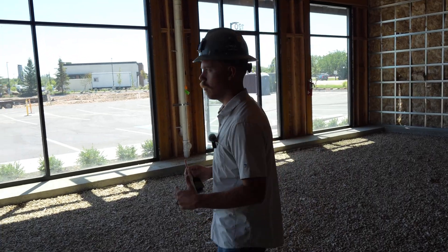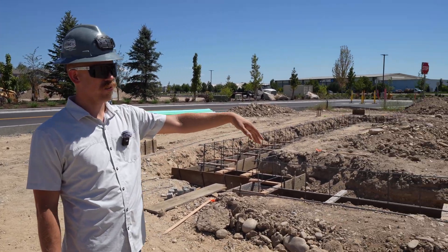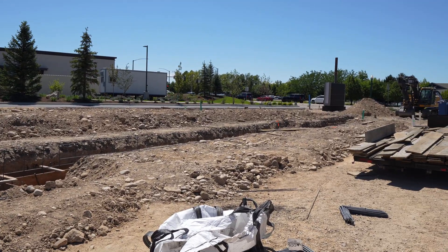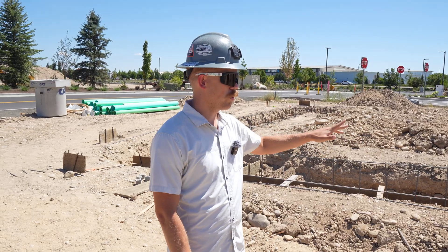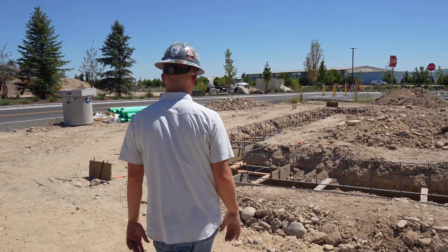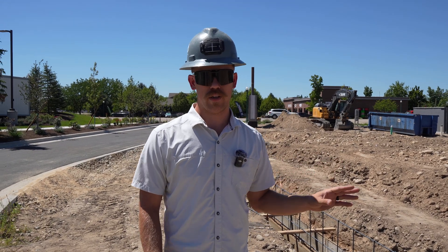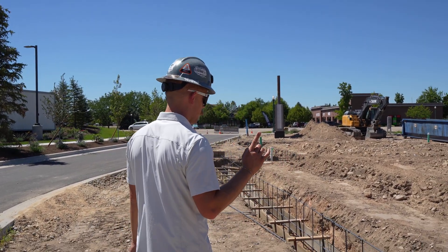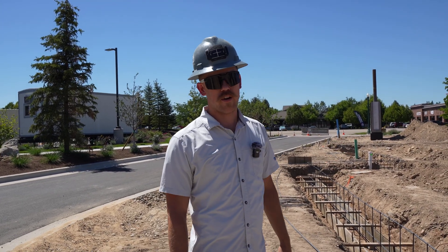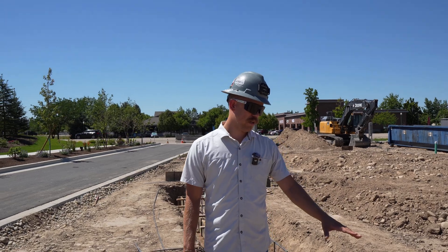Let's go outside and take a look at building 4. This is where building 4 is going to be. The foundation has been dug and the concrete guys are getting ready to pour the footing and the foundation. At this stage of the project we really only have one thing to do. This is typically the very first thing we do, other than maybe the temp power pole. For this specific building we don't need a temp power pole because we have power from the adjacent buildings, but we have to install a Ufer ground wire in the footing.